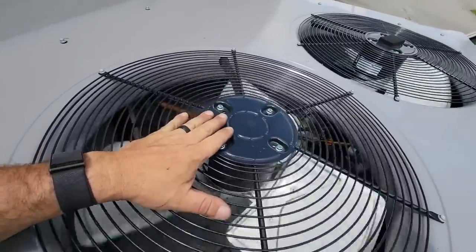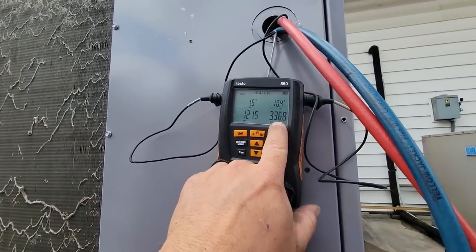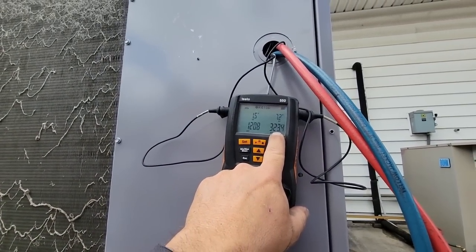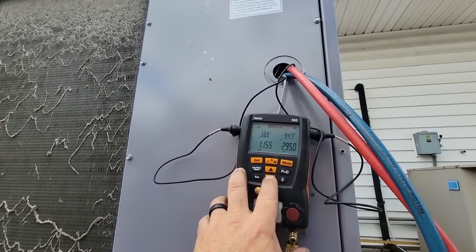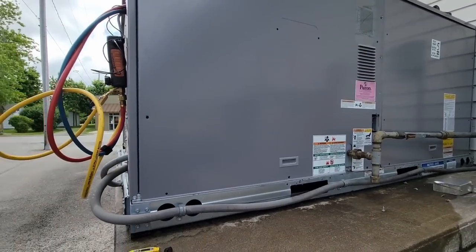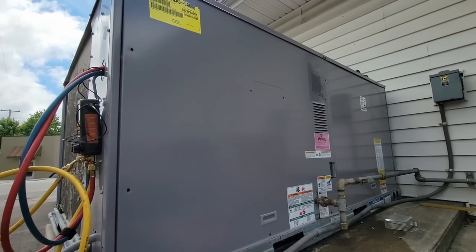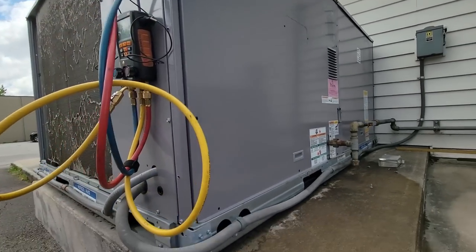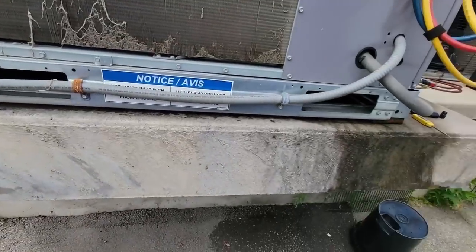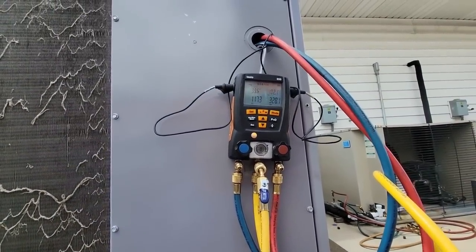So it's not running this fan here, which is probably why it's running such a high head pressure. Now look at us — we're around 300 and something, so we must have dropped down. Superheat's coming back — that's craziness. I'm going to say we need to check and see whether our Y1, Y2 terminals are calling if we even got a two-stage stat on this thing. Kind of curious what my temperatures are inside too, or did it finally trip a pressure limit or something?